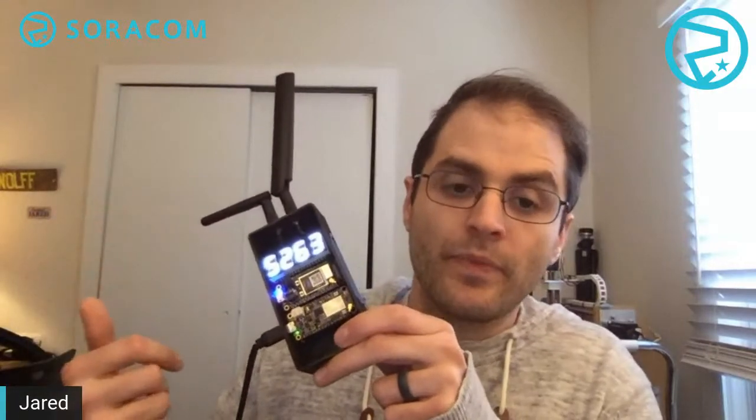This guy is talking to the cloud. I have an app that I'm using to communicate in real time to separate devices. You can kind of hear those relays clicking in the background on a separate board, which is all connected via Bluetooth as well. So I'm issuing commands on an app that goes to this guy, it pushes over to the Bluetooth, the Bluetooth communicates over BLE long range, and then it issues that command to whatever the device is on the end. The device does stuff and sends back telemetry data and all that. So by far, this has been a fairly complex project.